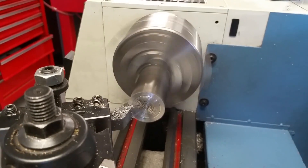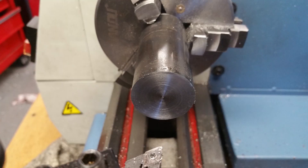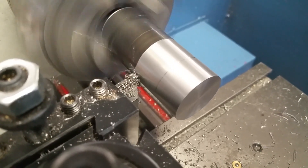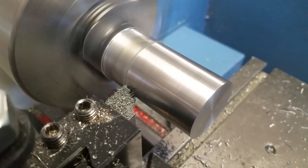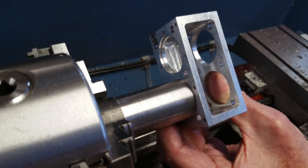Then we clamp it very tightly. Then we face off the workpiece and turn the outside diameter. I'm really liking the way this 1144 is machining — the chips are kind of like cast iron crumbles, but not near as messy. We go ahead and turn the outside diameter of the workpiece to the largest dimension, which is the diameter of the lip at the top of the cylinder. As we approach final dimension, we test fit it into the block, and that's how we know when we're done.